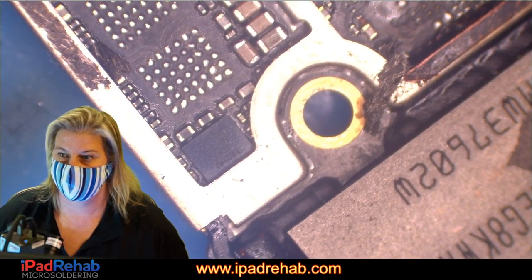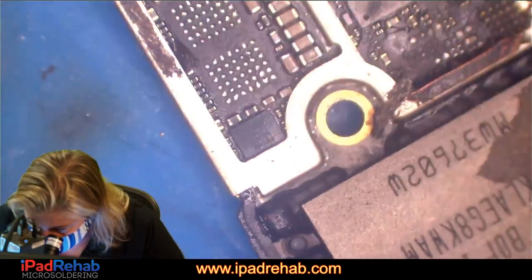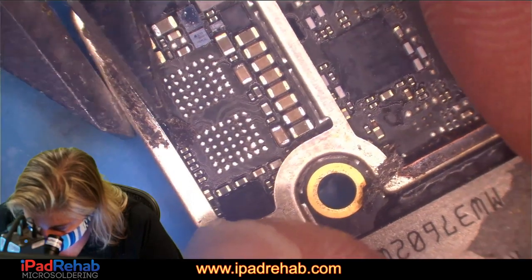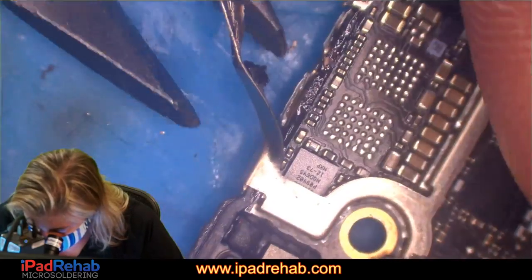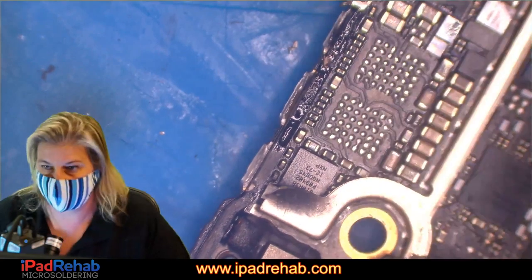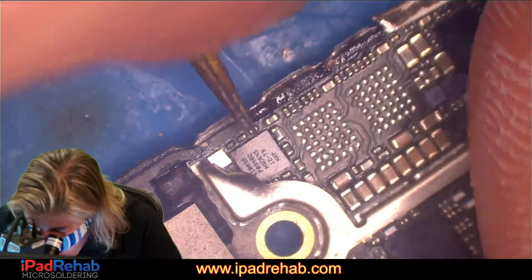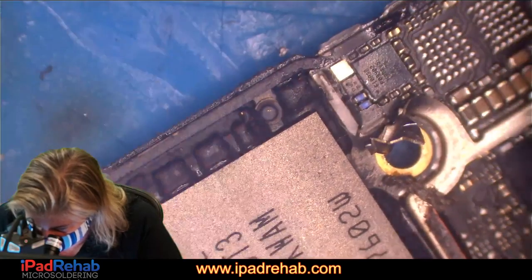All right. Let's see if I can cut. I just want to know whether or not there's a lot of corrosion on this backside of TriStar, because a couple of those lines are in this area, even though they weren't measuring short. So it's possible that instead of having a short to ground, you can have something bridged into a different line. All right, let's try to get this bracket to peel off in a way that doesn't destroy anything else.